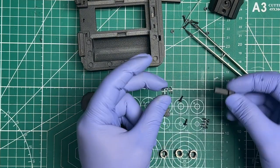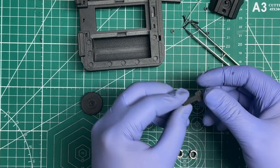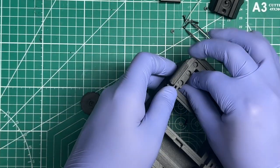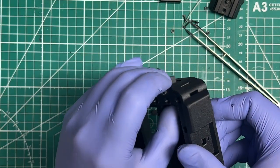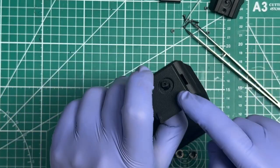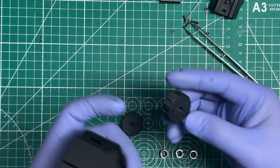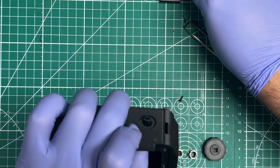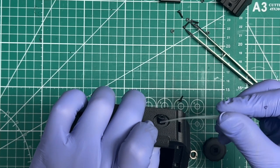First I put the spring. There's going to be 2 springs for this part here, which is the plunger. You take the plunger and the spring, you thread it through there and hold it with your thumb. You can feel it, test the springiness of it. And then this is the top one here, if you're orienting the camera in this way. So that's going to be your actual wind-up knob with the arrow. So how I do it is, at this point, I bring out my CA glue with the little droplet and add a couple of drops on top of here. You don't want it to run.